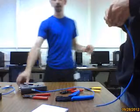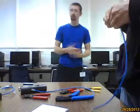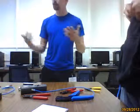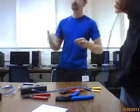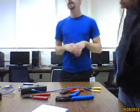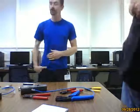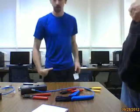But if you go into a place and somebody's used just whatever random pairs and whatever sequence just because they wanted to do it that way, one, that doesn't meet standards. A lot of times the EMI or the RFI can affect that. There's radio frequency interference, or if you're running wire around electrical units or around something that puts off an ambient noise of some sort, it could cause problems. So.